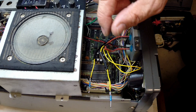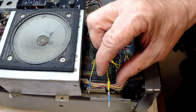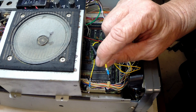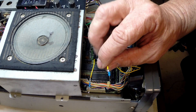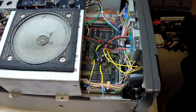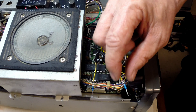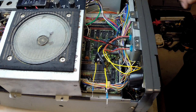We've determined that the LEDs are a bit bright for the application, particularly when the room is dull. So what we've done is put another 1.8K resistor in the negative lead — so there's one in the positive lead and one in the negative lead — giving a total of 3.6K series resistance with these bright LEDs. They also draw a fair bit of current; with just the one resistor it was getting noticeably warm, so the extra resistance should also reduce that effect.